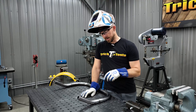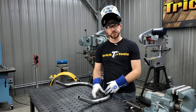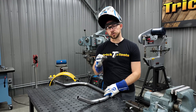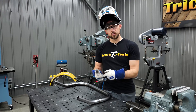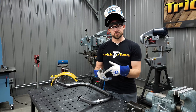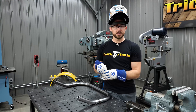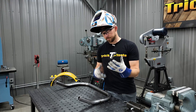With TIG welding, the whole purpose is to get that inner slug and the outside tube joined together, so I want to do that first before I add the rod and fill up the hole. If I was MIG welding, I would have made that hole a little bigger because with MIG welding you're adding wire into the hole immediately - as soon as it's sparking it's adding material. You need enough of an opening to melt the wire down to the slug inside the tube before you start filling the hole.